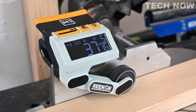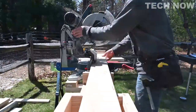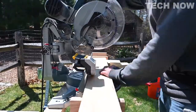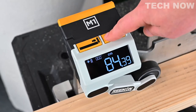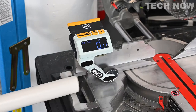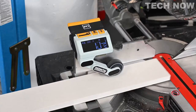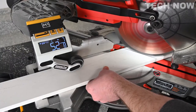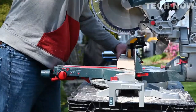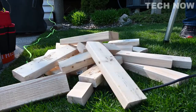The M1 is a powerful, fully integrated augmented tool that outputs the linear measurement of anything slid underneath it, eliminating the need to measure and mark materials. The large backlit screen allows you to select English or metric units and is visible in a variety of lighting conditions. A dynamic spring-loaded arm automatically adjusts to the material being slid underneath it and works with a wide range of geometries and thicknesses. The M1 clamps directly on most saw fences, automatically compensates for the blade thickness, and allows for uninterrupted continual cutting, making quick work of any material and cut list.